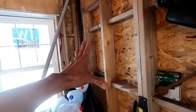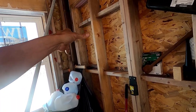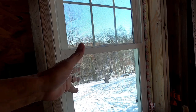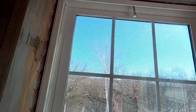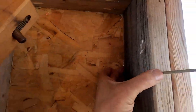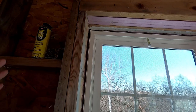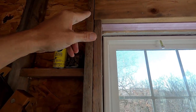Actually, this is framed out for a door and then just covered over. I'm going to open this up later — a year or two — and put a door there. This is the exact same thing, and I have a window in here temporarily. Once I take this out, I'll be able to put a door in here as well. This is how doors are normally framed. With two-by-six construction, your main studs here — if you have a header here and a header on the outside — you can fill that gap with foam, so you don't have an insulation break right there.